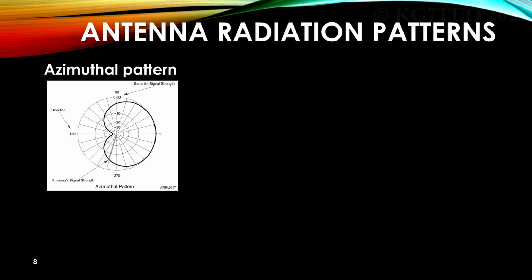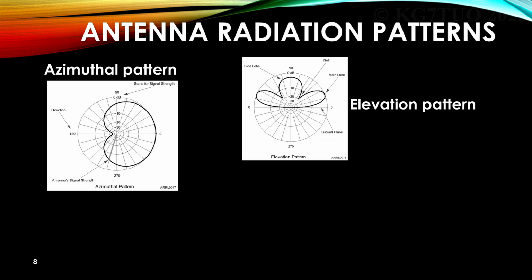And with a directional antenna, to get gain, you have to take it from somewhere. So we're taking it from the back and sending the signal out toward the front if you're using it on transmit. If you're trying to use it to find something, you use the null because that tells you what direction the back of the thing is.